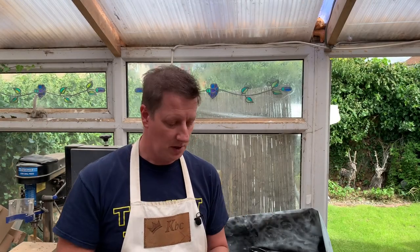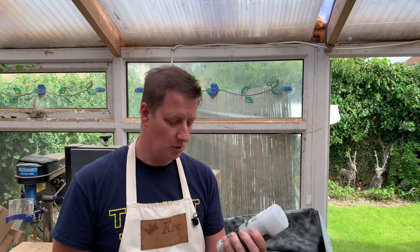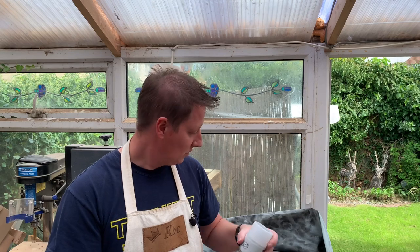It's now time for the lacquers. I've not used this type before, other than on my little test piece, and it seemed to work quite nicely. This is where your finished guitar will quite often win or lose. Thankfully I'm doing a rustic approach, so it's okay. I'm not a perfect sprayer by any stretch of the imagination. If you want a pristine gloss finish, I certainly wouldn't be using lacquers — I much prefer using oils, and you can coat those through and polish them up and get a really nice finish very easily. The advice is: read the can, thin coats, 10 to 15 minutes between intervals. Check the label on the one you've bought and it'll tell you exactly how to do it.